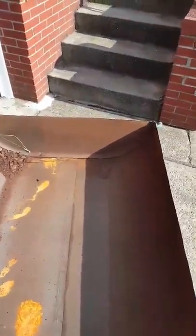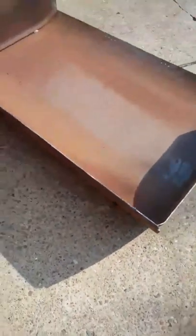Put a cut hole right down in here so that we put a little lift on this side so that all the grease will run down into a trap pan. Make cleanup a lot easier. This here is going to be obviously the lid. We got the holes for the hinges. And then I'm just going to use pieces of the legs from the actual container. We're going to screw them right into there and use the legs as the handles.